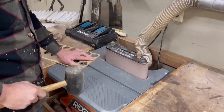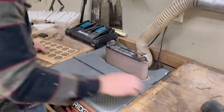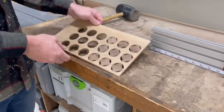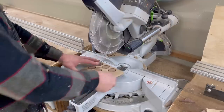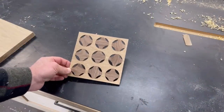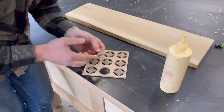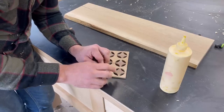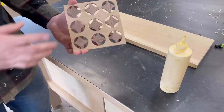Seriously, this was going to take a long, long time. After cutting out the pieces on the bandsaw, I had to refine the cut over on the oscillating belt sander. I got some pieces in there and it did look a lot better now that everything was on the same level, but I still wasn't super happy with it. I cut down my little sample piece to isolate it and get a better look, but even after that, I just wasn't thrilled. It was really hard to cut the walnut pieces uniform and consistent. Even though it kind of had a funky handmade look, I just wasn't thrilled. I thought perhaps the walnut was still a little too bulky, so I hand-sanded each piece down to make it thinner so the holes around the perimeter were bigger. But this made it even harder to get all the walnut pieces exactly the same size, which meant that my pattern, although it looked much better, still wasn't uniform and consistent.